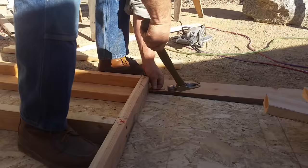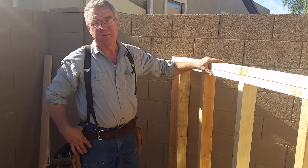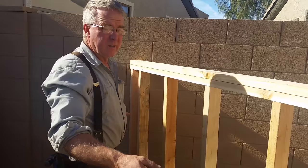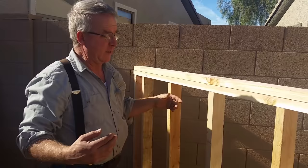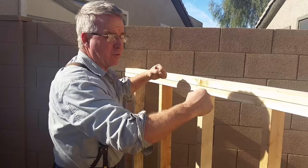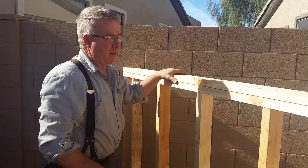Why double the top? Crown plate, top plate, single bottom plate. There are a couple of structural reasons. When your wall is long — longer than the length of your plate stock — you need to be able to stagger the joints between the top plate and the crown plate in order to plumb and line the wall, getting it braced up nice and straight before the roof system starts going on. Staggering the joints is vitally important.